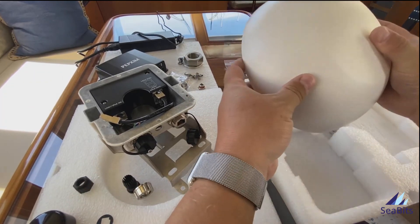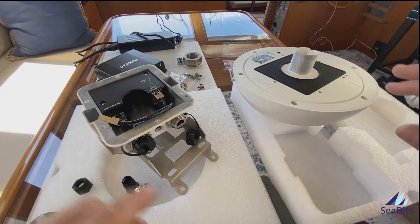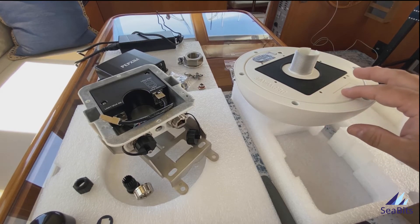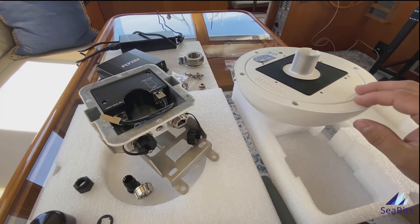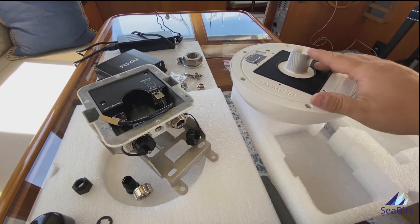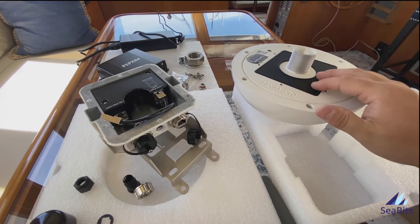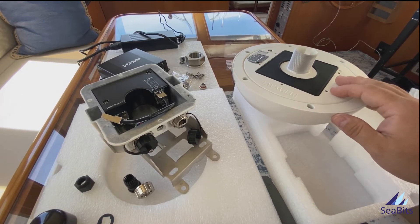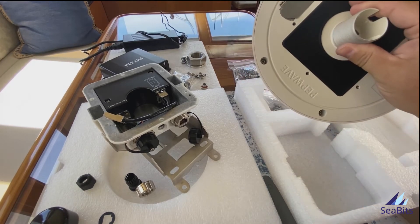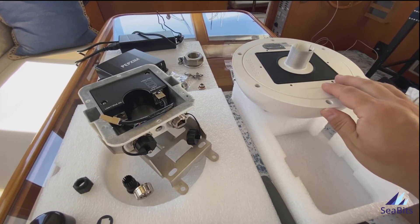The biggest differentiator is being able to use just a plain old Ethernet cable to connect into the dome and power it. You do not need the SIM injector — you can put SIMs directly in the dome, but that does require opening it up. However, if you don't hardly ever need to change them, that's totally a viable option that saves you $1,000. Then all you need is something to generate PoE power. I use Tycon — they make a bunch of different PoE injectors that go from 12 volts up to 48 volts and do the different types, including AT or AF, for about $60. I did test it and it seemed to be fine.